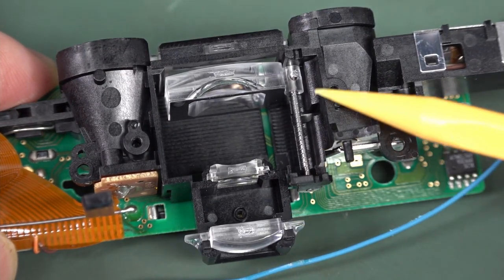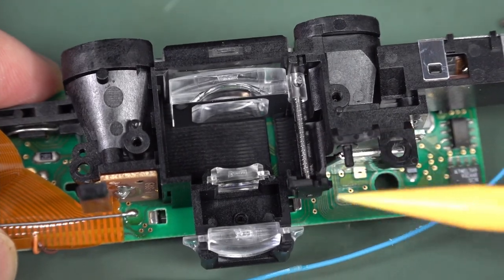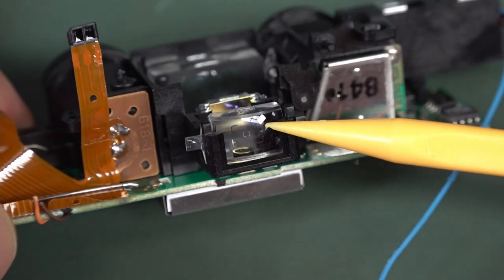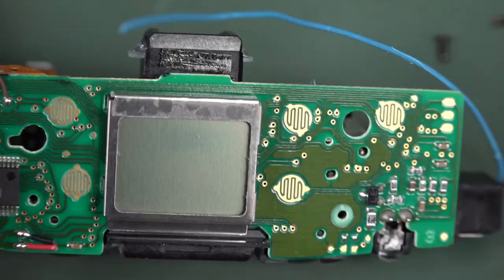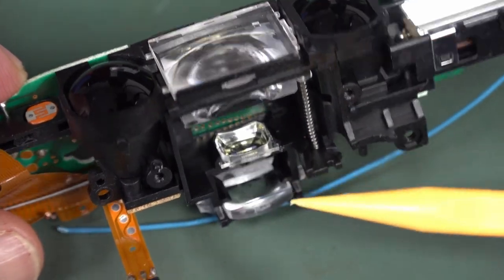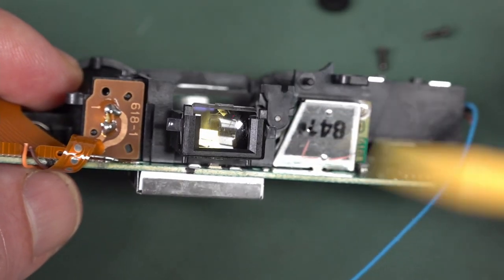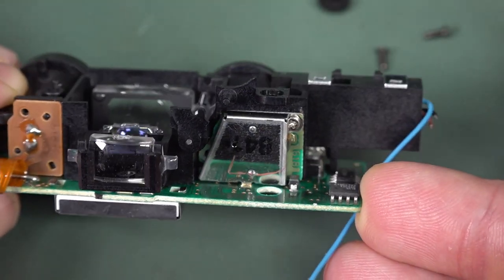There's the viewfinder assembly — you can see the worm drive down in there that will pull it back and forth as you do your zoomy business, but apart from that they've just got some lenses in there. You can probably see on the window the frame and focus bit. It doesn't look like it has an LCD on-screen element that turns enunciators off and on — mustn't have that. And you can see the infrared here — this will be the transmitter, just an infrared LED, and this will be the receiver with a shielding can on it. It's got its own little board so there's a little preamp thing happening in there.